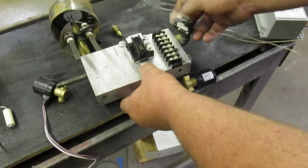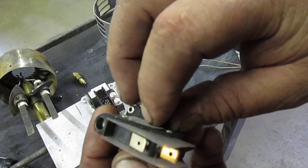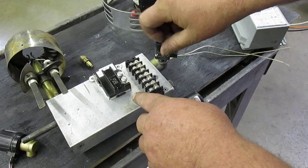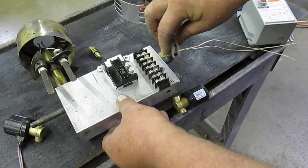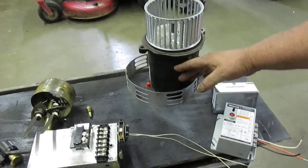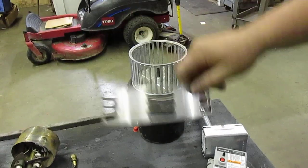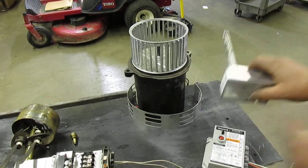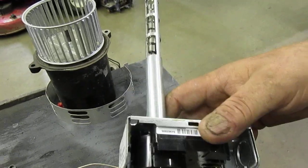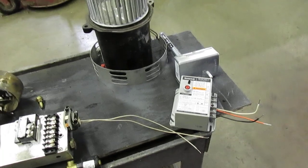This is the low air proof switch. When you have good air pressure, that switch closes and goes and starts the oil pump on the tank, sends oil up to the burner, and then you get a flame. Here's the burner combustion air blower motor and the squirrel cage, and here's your air band adjustment that rotates over the hole to open and close it. This is what your fan limit control looks like. There's a video of this on our website — there's a link to click on for more videos, including a fan limit control explanation.